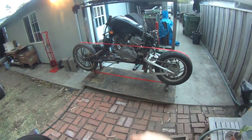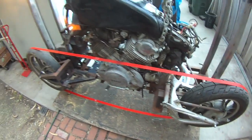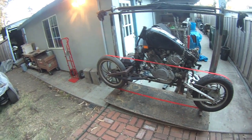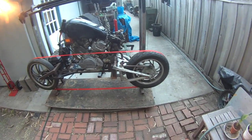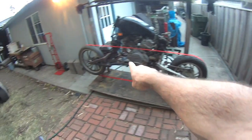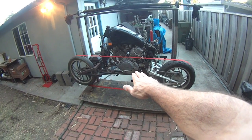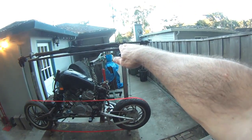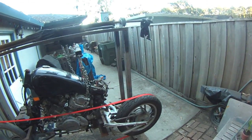I'm not using a blade that's going to have teeth on either side. I don't need to cut in both directions. That just makes the blade more expensive and a little more brittle, because you've got cut ends on either side. So with that being said, this whole assembly, this whole engine right here, is on a horizontal bed that can raise and lower up and down these 4 2x2 steel posts.